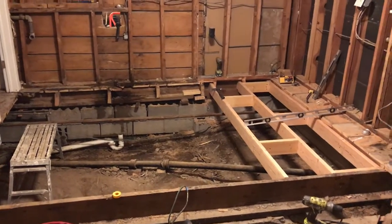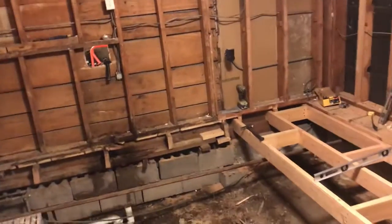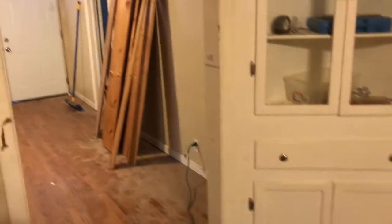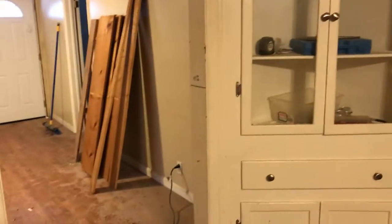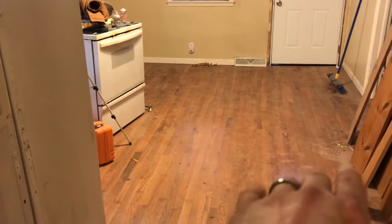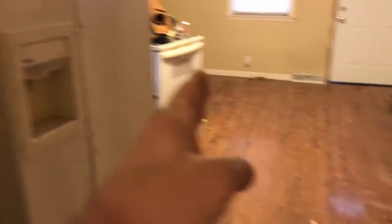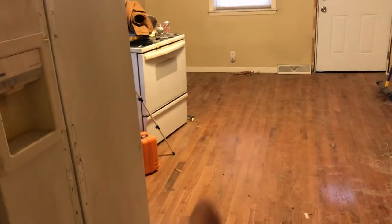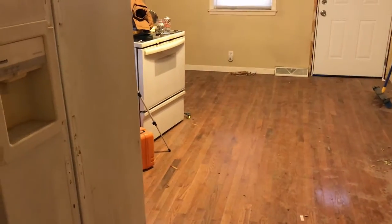From there I'm going to move to this wall that runs down the center of the house — it goes wavy, so I'll have to lift it up in certain places. Then I'll address the bowing in the centers of the joists. Once I get this level to this exterior wall, I can address that bowing by putting supports in the center.